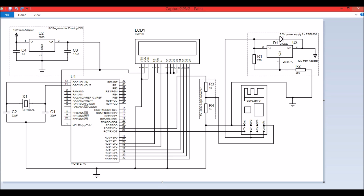The connection is established using the USART module — Universal Synchronous and Asynchronous Receiver Transmitter. The ESP module by default comes with firmware uploaded by the manufacturer, which can be used to program the ESP8266 using AT commands. What we are doing is sending those AT commands from the PIC microcontroller to the ESP8266 module using the USART module.